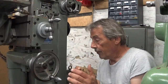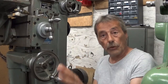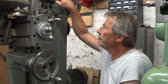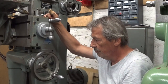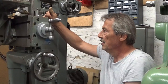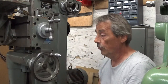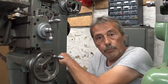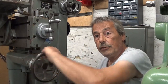I wanted to end this video showing you the perfectly bored-out little piece of pipe, but it's not going to happen. There is a bit of a problem with my Deckel. If I feed down, it works, but this handle gets stuck. And when I try to feed up, the shear pin hidden below in the system breaks. When I turn by hand, it's really easy to turn up and down — no problem at all.